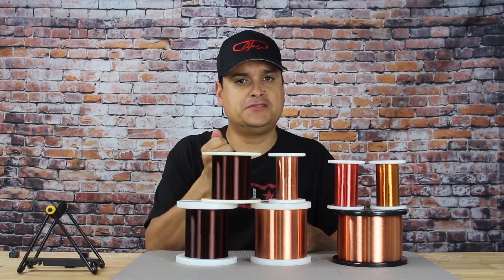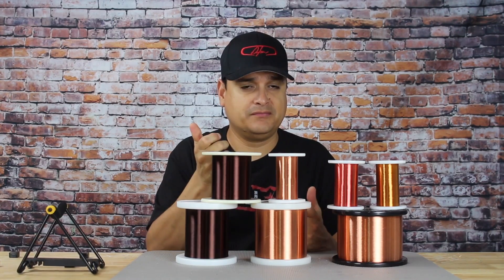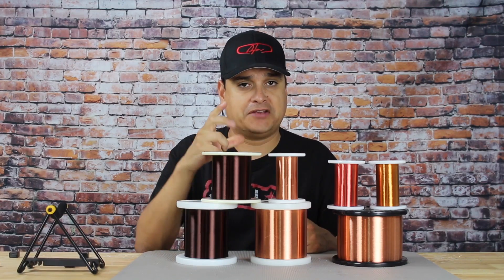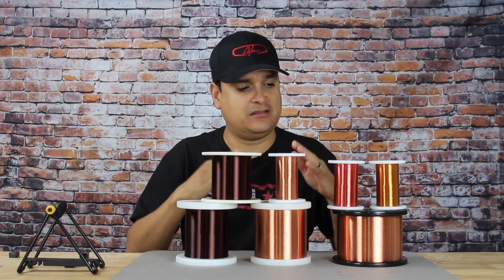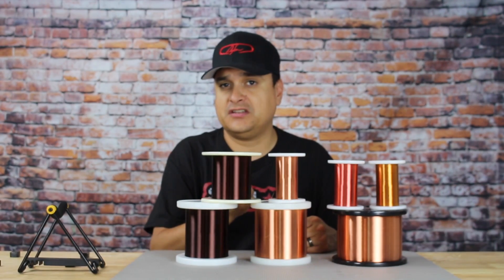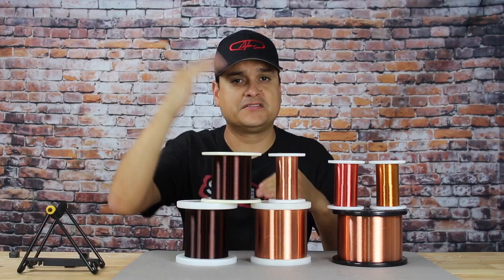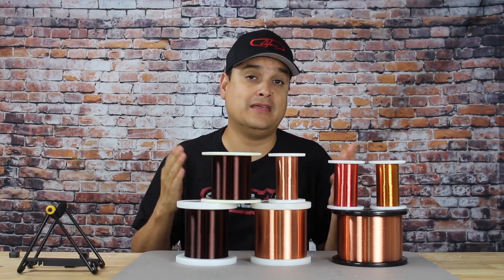When we're talking about tension on a guitar pickup, as the wire is stretched, that changes its resistance. So as I am winding the wire onto the pickup, I can actually vary the tension without breaking it — which is half the art, or black magic, or voodoo, or whatever you want to call it. If I stretch the wire, I can vary the resistance from its nominal resistance per foot in that section. When you stretch it, you've made that wire thinner at that point, you've raised the resistance at that point, and now you have an unevenness in your coil because you've changed the resistance in that section.